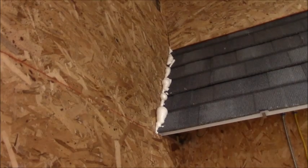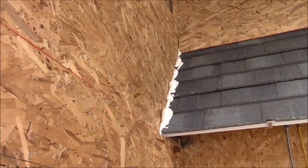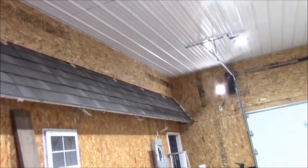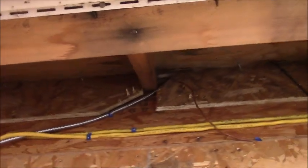I felt all kinds of air blowing in around these windows. So I got out some expanding foam. This is too narrow for the foam to get in, so I've got to just caulk those, but I'm waiting for this foam to expand. Up there by the rafters, where the old shingles came through, he had cut back the shingles down to the bare decking, so I was able to shove the nozzle back in there and really seal those good on both ends. I guess maybe I said this earlier, but I'm going to have to get up in here with regular caulking and caulk around the edges of those just to help keep cold air out. You know, I have to pay for it. But man, there was a lot of wind coming in around these windows, and since I put that foam in there, it's just gone. So that's a good thing.